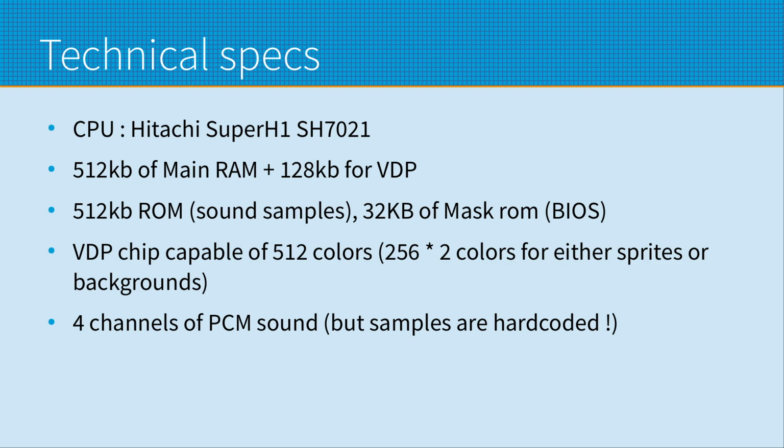So when the CPU resets, the master reset vector jumps to address 0, which is where the mask ROM is stored. I believe that's how it works. It works something like that on the Sega Saturn, which used an SH2. I should also mention that the SH1, although it was only used on the Casio Loopy as a main CPU, the Saturn used the SH1 for the CD drive as well, which I believe is a bit overkill, to be honest, but it was mostly used for asynchronous loading and stuff.